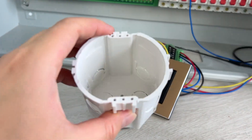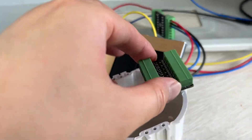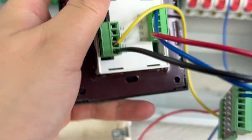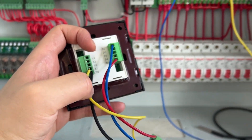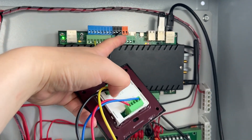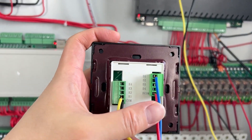This will be very easy, and also you can easily install it on this DIN rail shoe. There is enough space — put it here. Just connect with your wire. This is K1. I have connected K1 and KCOM. K1 is just from the digital input — from the controller digital input. And this black that is KCOM, that means the ground. This has connected with the ground, and you can also connect with this black, because this is all ground connected together inside. And this is the LED feedback.